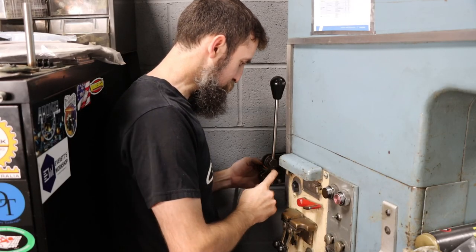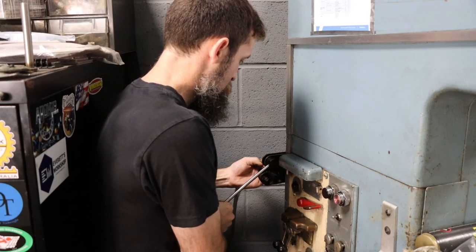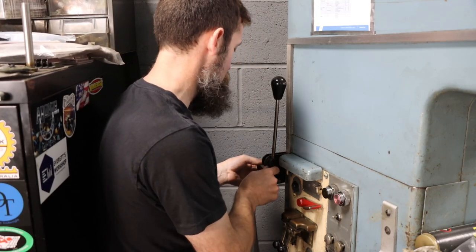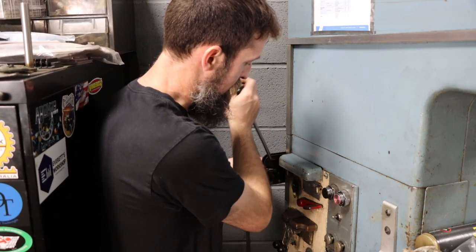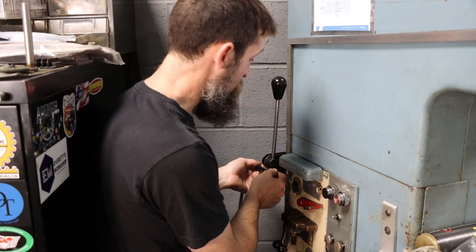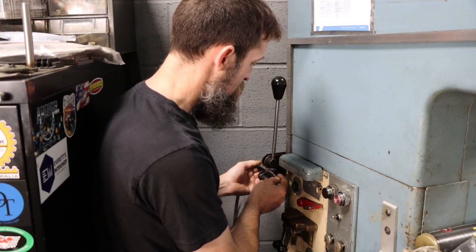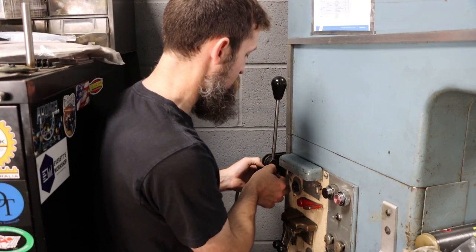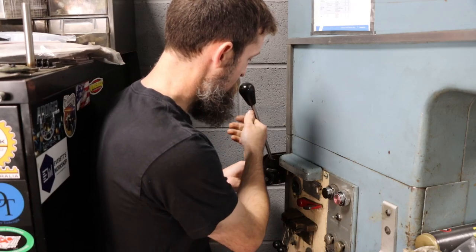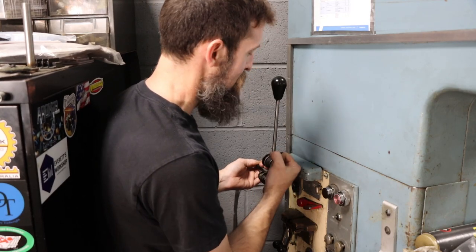All right, so all the way out at the front of the blade. Sorry for the horrible shot, but this filing cabinet is in my way. So, pretty good, a lot better than what it was before. It's not super easy. At the back of the blade it's like butter, but that makes sense because it's got so much leverage back there. But at the front, where you should cut your blades anyway, because that's what these ears are for, to make sure that your blade is pushed up good and square. That way when you weld it back together, it's already square. So try it again. Yeah, a little effort, but light years better than what it was before. So I would consider that a success.